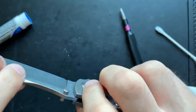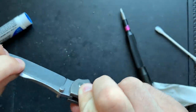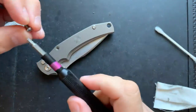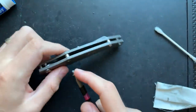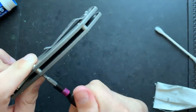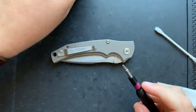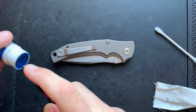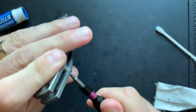Let's go ahead and drop all of this into position, snap that into place. What I'm going to do here to start with is reinsert the pivot using a little bit of blue threadlocker - I'm using this Loctite on a stick. This is a very straightforward disassembly; I'm actually quite happy about that. I was a little afraid that I'd be dealing with threadlocker or some other weirdness in any serious quantity, but no, this is going well. I'm going to put the pivot in and lightly tighten it for the moment, making sure the button lock doesn't come flying out, and adding threadlocker onto this part right here.